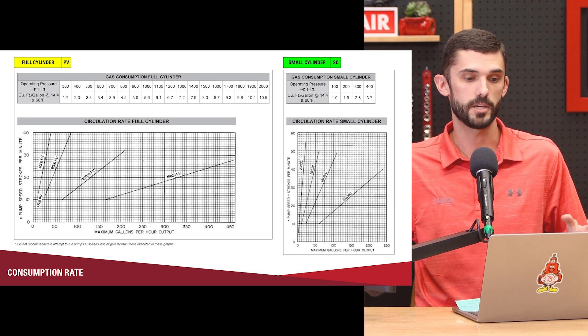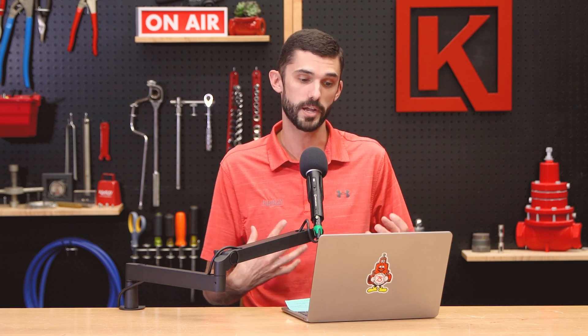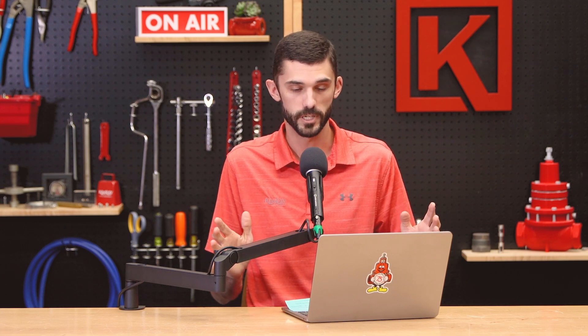As that glycol goes through our glycol pump and circulates throughout the rest of the system, it's having that water removed from it so that it can be dry glycol and be ready to absorb more water from the contact tower and the gas. And then that cycle just continues over and over again. Because it does not require any external power, these systems can run with no electricity, even though there are some automation elements that can be added in to a dehydration system. At its basic form, it can operate with no electricity — not only the glycol pump, but also all the other pneumatic controls that are in the system.